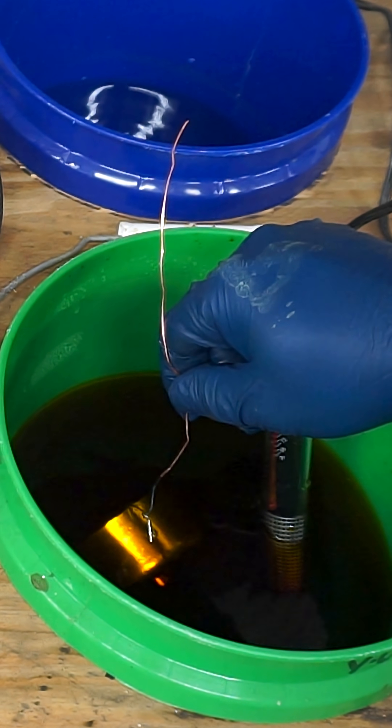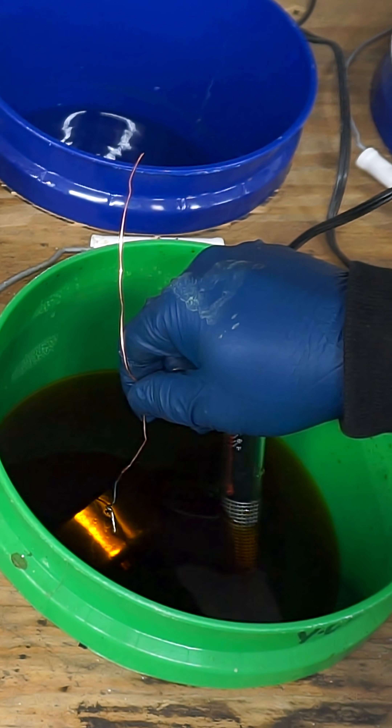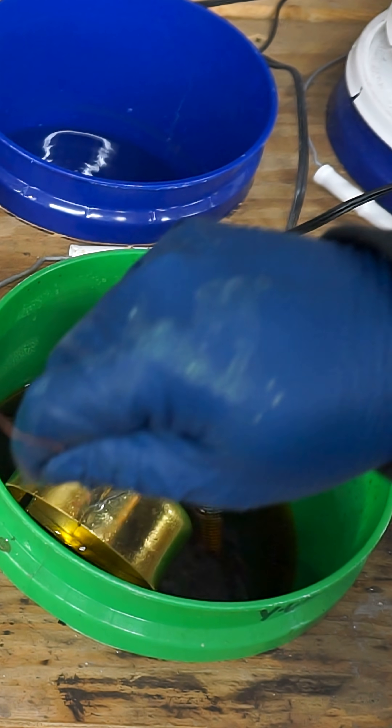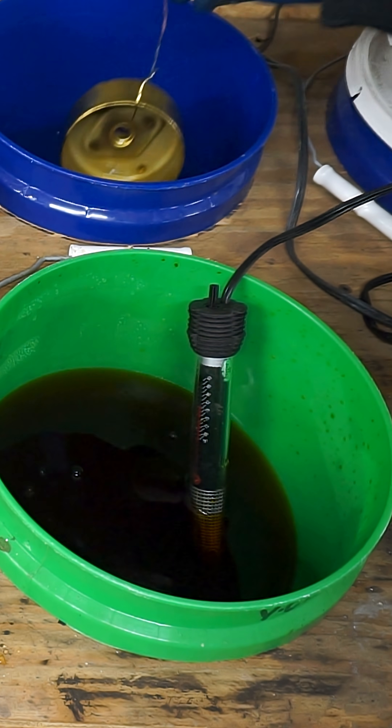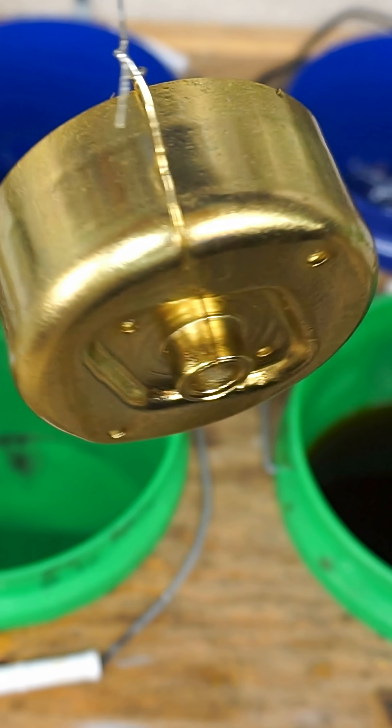A lot of hardware is yellow chromated. And then it goes into a rinse to stop the chromate process. Then this gets dried. You can use an air dryer to dry it, or just let it air dry, or put it in a convection oven.